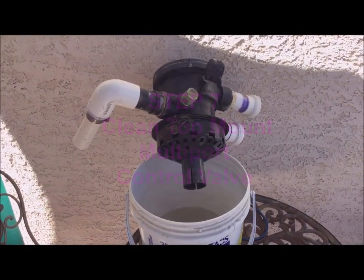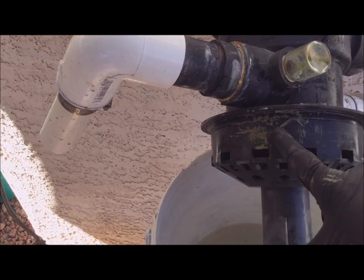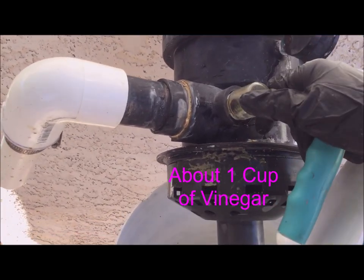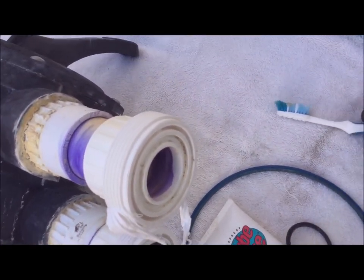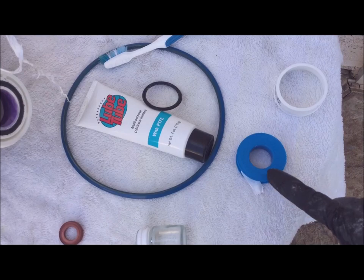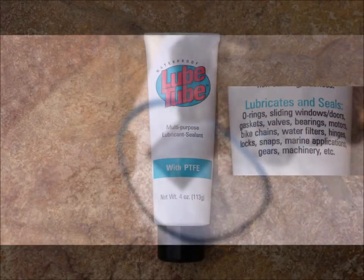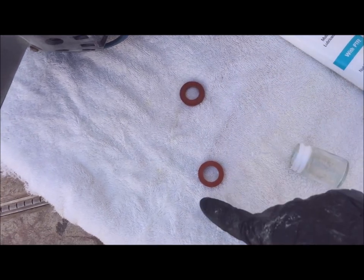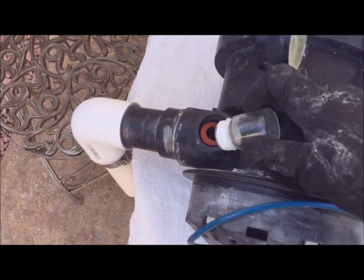While the water is draining from the tank, now is a good time to give the control valve a good cleaning. To remove all the hard water stains and green mess I just used a little bit of vinegar in a bucket of water and a scrub brush. With the O-rings off, clean the area with a small brush, remove all the old Teflon tape and replace it with new tape. Now would be the time to replace any damaged O-rings — give all the O-rings a nice coat of O-ring lubricant. You may have to replace O-rings that are cracked, damaged, or just stretched out.